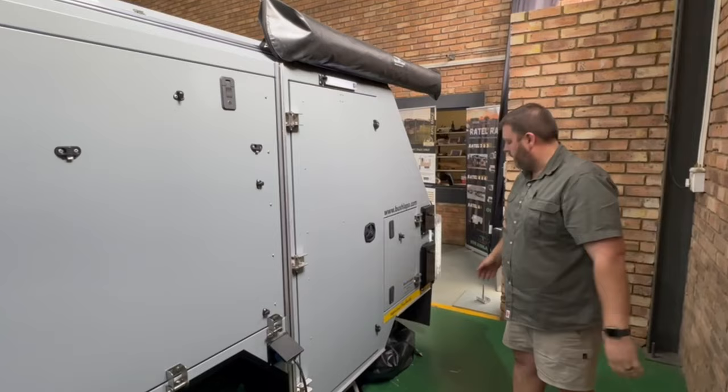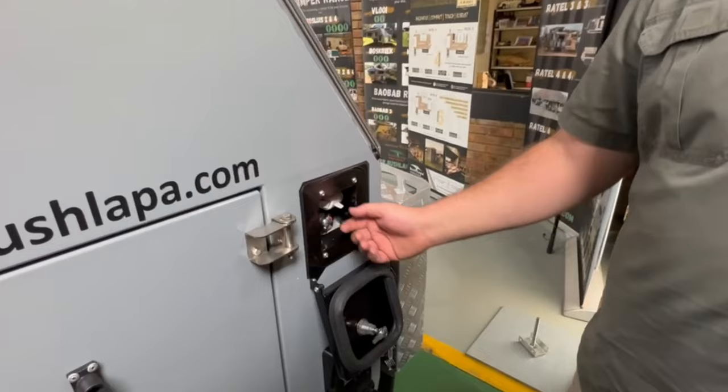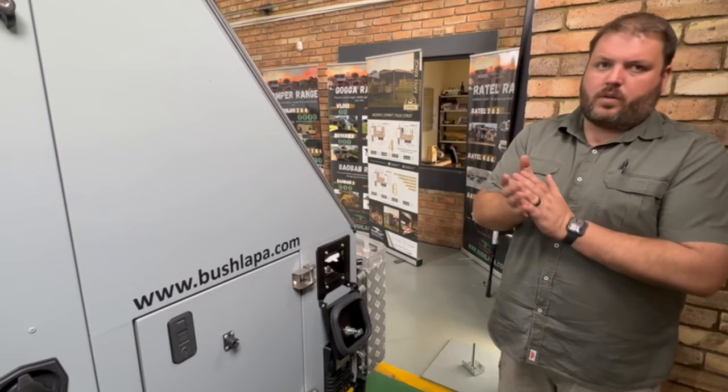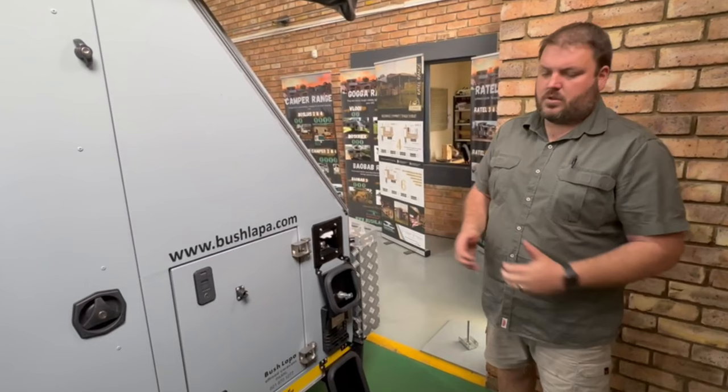While we're on this side, I can quickly show you guys the new geysers. On the Hansen geyser, this is your exhaust vent for the gas side. Before you start up your geyser, always remember to bleed your geyser. First thing would be to switch on the mains on the 12-volt side, switch on your pump, and then just run a bit of water through here until you get a constant flow running through the geyser. Then you know your geyser is full of water. It's very important, especially on the 220 side, to make sure the geyser is filled with water, otherwise you might burn up the element. On the gas side, if the geyser is halfway full it's okay, but try and fill it as far as possible and then start up the system.